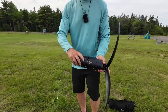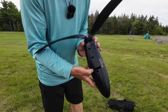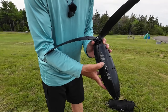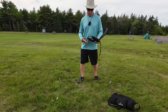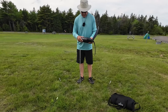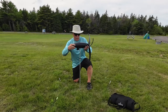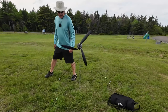On the bottom of the turbine there is a mounting hole that goes on top of the mast. Here of course are the USB Type-A output and micro USB input ports. Your back should be to the wind so you're keeping the turbine protected from the wind until you get it mounted — you can actually hold the whole thing sideways to the wind. Then turn it into what you think the wind direction is and you're off to the races.